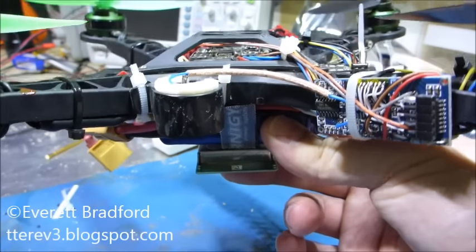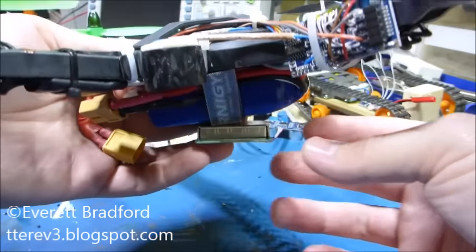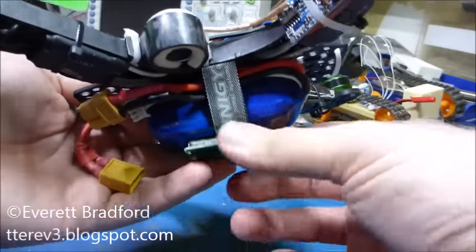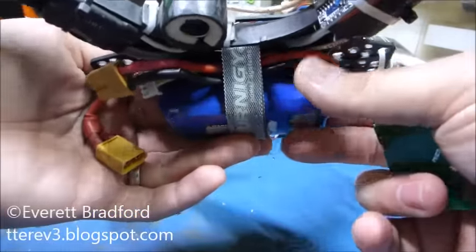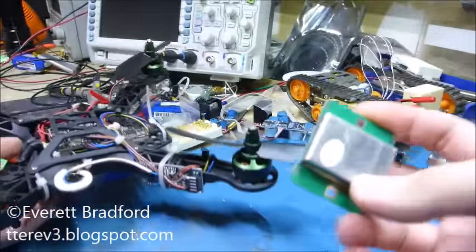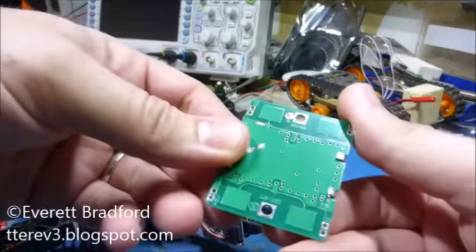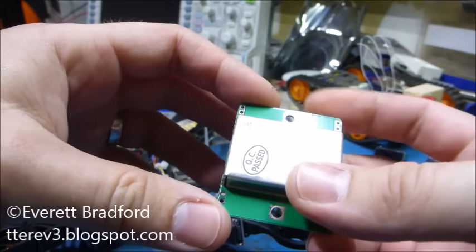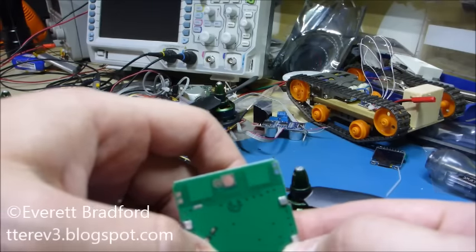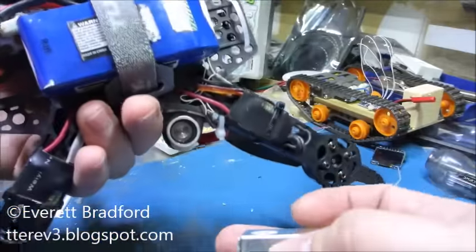That would be a much faster and hopefully less interference-prone signal. If I get the quad to near-zero vertical speed, I can use the sonar to get a ping every once in a while and not rely on real-time sonar information nearly as much. I've got some boards on order that do amplification and bandpass filtering for the radar modules so I can hopefully use them to get a vertical velocity number, run a separate control loop, and use radar and sonar combined to get this to function.